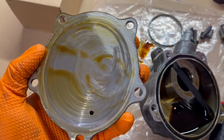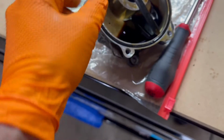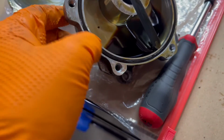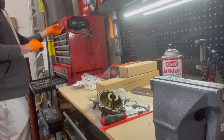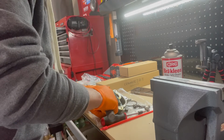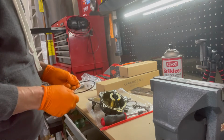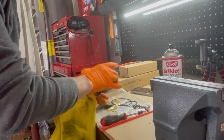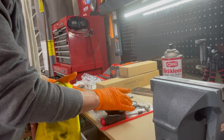There's the back side. Not much to it. What I'm going to do now is pull out this O-ring here, which feels rather flush, so it probably was part of the leak. Anyway, I'll get a pick and pull that out. Where's the brick? I'm going to clean up the inner surface now, and put in our new O-ring.